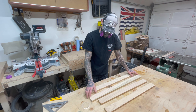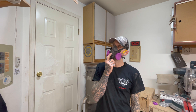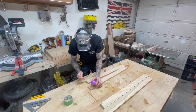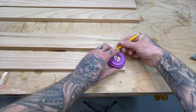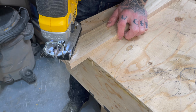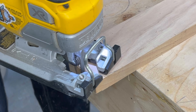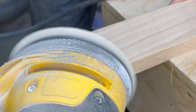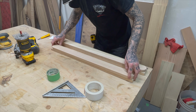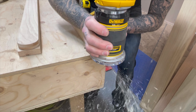I lay the pieces out on my bench, and I'm looking for something that is going to give me a nice round profile on the ends of each of these stringers. But I couldn't really find anything that worked. So after some hard thinking, I finally found something that will work — the dust cartridge on my mask is going to be perfect. I want all my stringers to be the exact same length, so I took one of each length and cut them very close to my line, and then sanded the rest off with my orbital sander. Then, once I had both legs dialed in, I two-way taped them to each other, and used my DeWalt cordless jigsaw to cut close to the template, and then my router with a top-bearing flush trim bit to eat the rest.